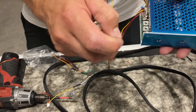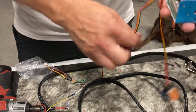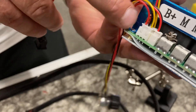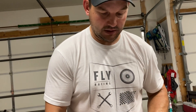On the stock PWM you get a forward/reverse switch and a pulse-width-modulation knob that controls your speed variation. One thing to point out: even though all these PWMs look the same, the wiring is not the same on all of them. If you swap out a cheaper controller for this one, what was 'off' may actually be 'all the way on' when you go to turn it on, so you could have issues right off the start if you don't recognize that.